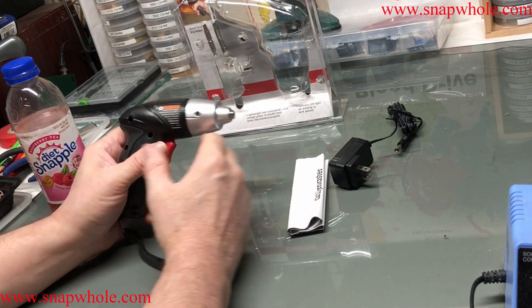NiCads require a lot of management. I've actually been replacing my NiCad batteries in tools like this with lithium ion or nickel metal hydride. The Bauer is lithium ion. This comes with four bits — two sizes Phillips, two sizes flat tip. The bits use a magnet; I like that, it's a pretty strong magnet. It's a nice tool, perfect for electronics. 180 RPM is slow, it won't have a lot of torque — that's what you want in electronics. You don't want to over-torque your screws or cam out and tear something up.